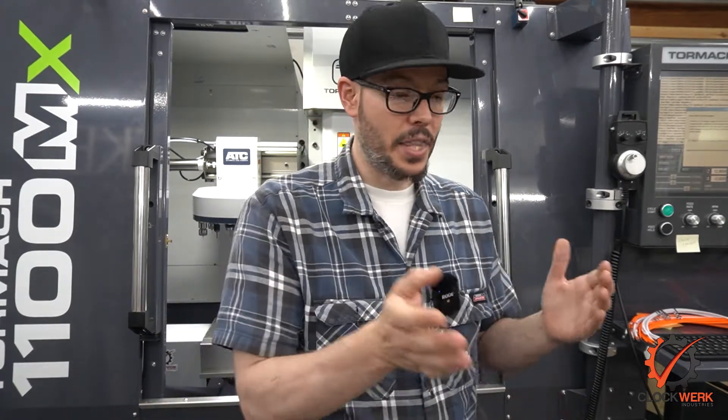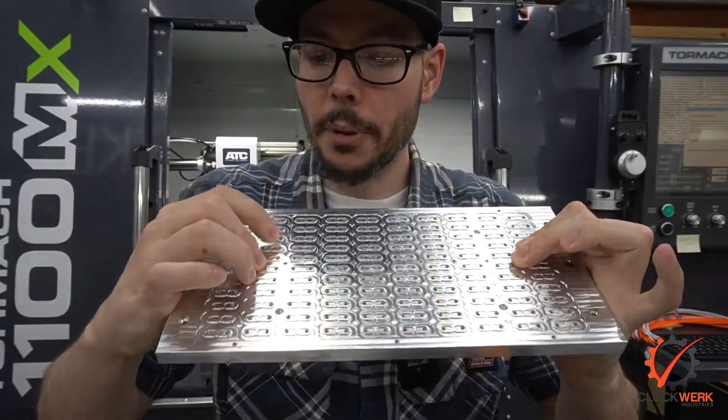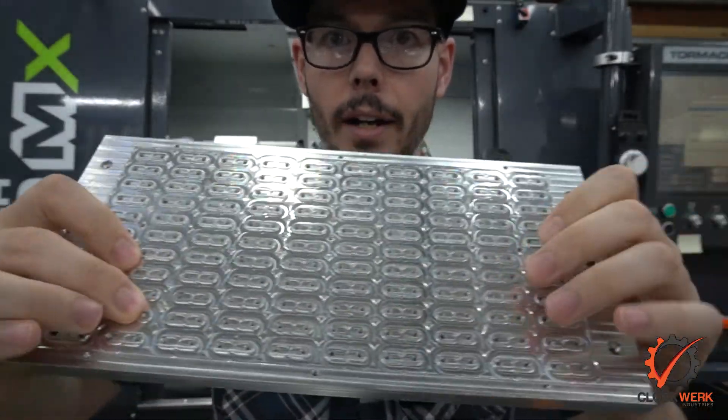Out of necessity I had to figure out how to accurately cut on both sides of a piece of material to cut that many parts from one sheet. I basically devised a method — and it's pretty straightforward and used in tons of applications. You can see on this fixture there's a dowel pin hole right there, another one down there, and the same on the other side. The main point is that they're symmetrical. The key trick is making sure your dowel pins are symmetrical on the axes that you need to flip.